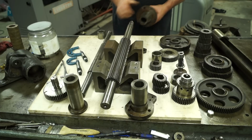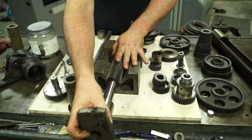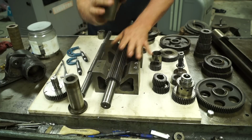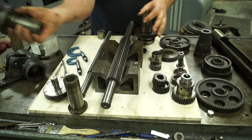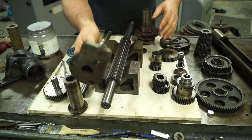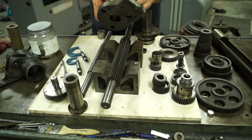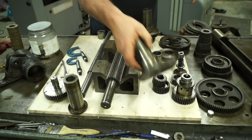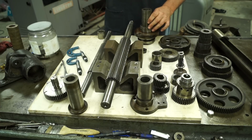And on that end you had this fit. And there's an oil passage down through there, I don't know if you can see it. If I'm not mistaken, this bearing was turned at an angle, so the wear surface is probably going to be across here the greatest. So that's what we're trying to measure, and we'll take about 3 readings off each one of these.